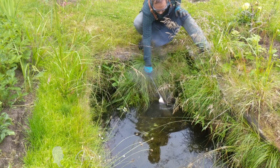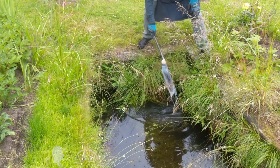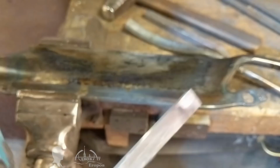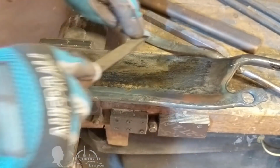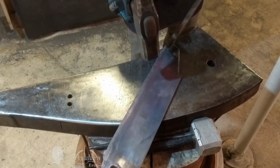The plan succeeded. I briefly placed the knife in the forge, and since the blade's spine is thicker and more massive than its cutting edge, it did not have time to really heat up, and when immersed in water, only the cutting edge would harden. I should have stopped right there, even though the blade's cutting edge slightly curved at that point.